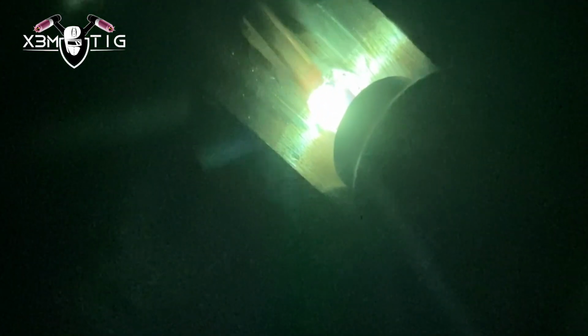Okay, on the top part, as I said, you want to dip. Just dip, hold that rod above that edge. So when you're doing tie-in, you want to pause one side, other side, one side, other side, and slowly connect. You don't have to rush here. You want gravity to work for you. You want to burn those edges. You want to make a nice blend connection.